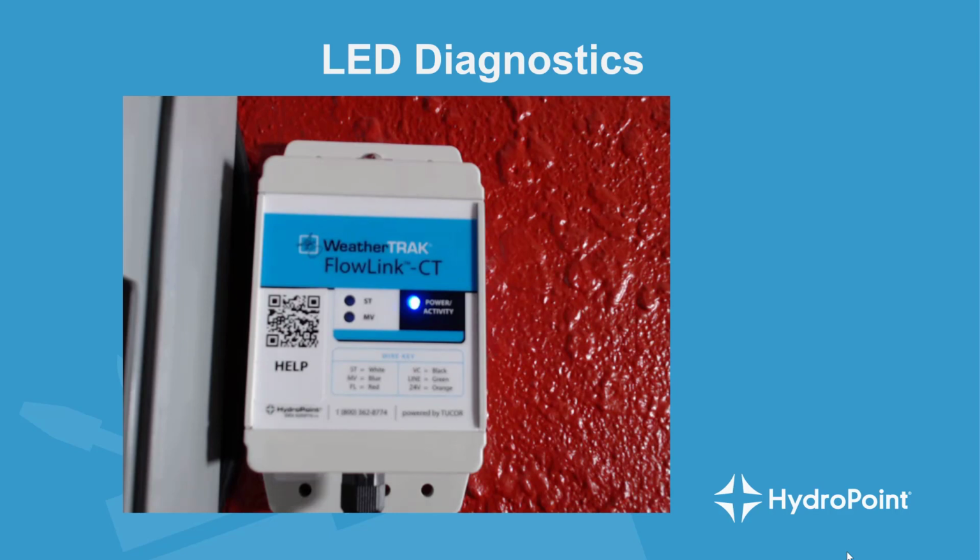If the constant flickering continues, that usually means we're not powering the devices in the field, and likely you've used the wrong field wire, or you've chosen a field wire that has a break in it to try and run your FlowLink circuit. So once you've got a solid illumination from your power LED, the next test is to turn on your master valve and check to see that the master valve activity light illuminates.